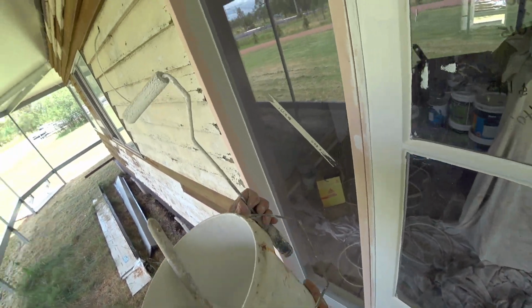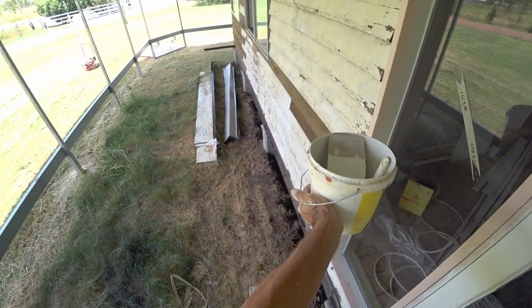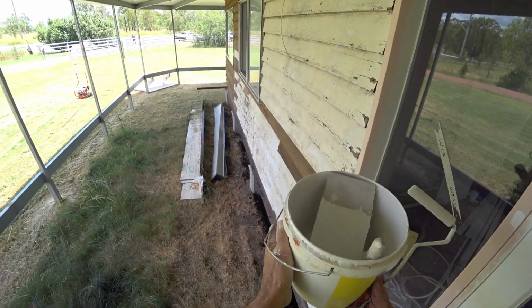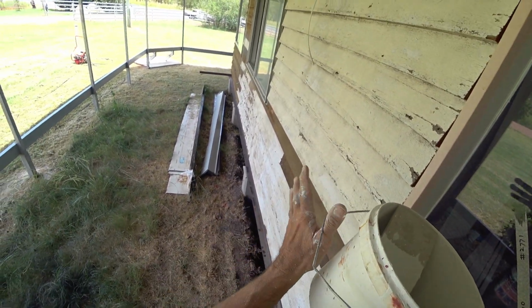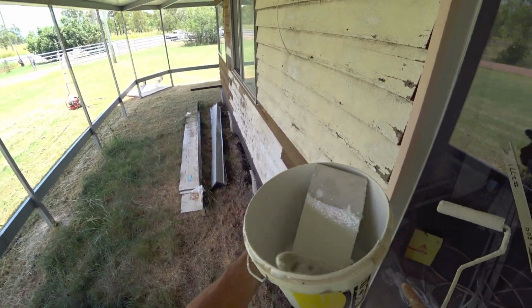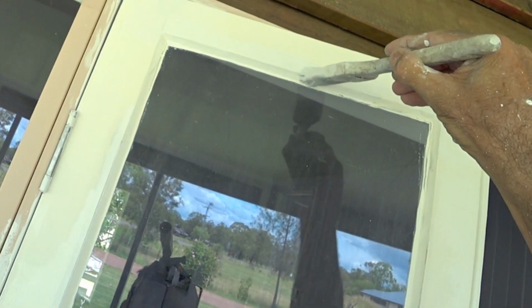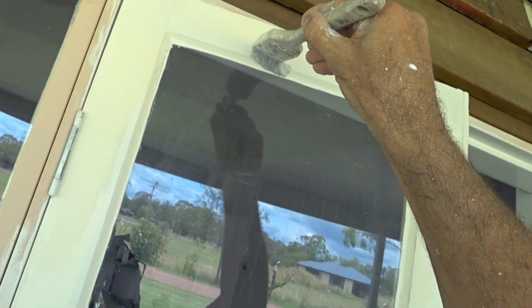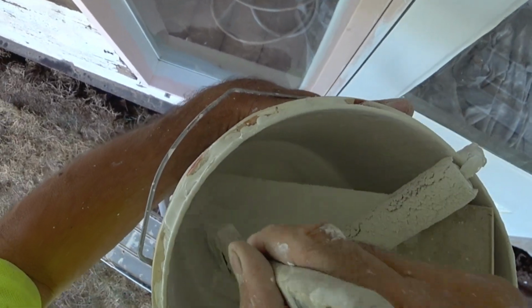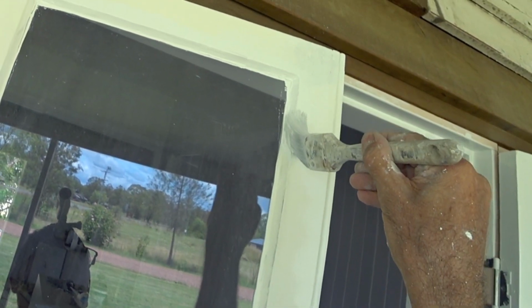This is how you correctly hold a pot, by the way. So you guys are using the big buckets, but you have a pot like that, and it's a cut bucket you call it. Put your thumb in there and hold it up underneath. Hopefully you can see. Nice full brush of paint. Make the cutting in nice and straight. Can go over on the glass, it's not a drama. Actually designed to go over on the glass because it's nice and straight.